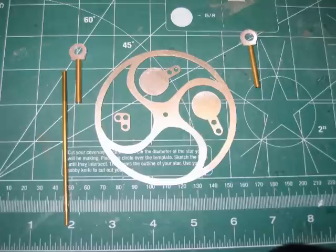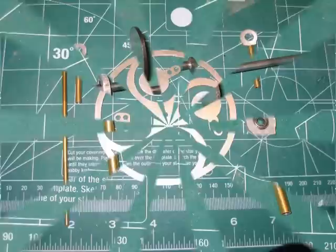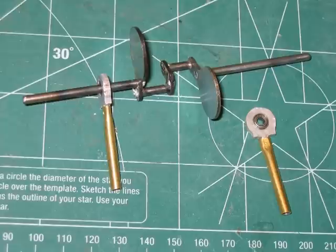The flywheel and crankshaft parts were cut from the bottom case of some electric junk. As long as it is softer metal than your blade it will be fairly easy to cut. Also try to pick something easy to solder. This is the assembled crankshaft. Admittedly I am not the best at soldering, and the metal ended up being a little difficult to solder as well.